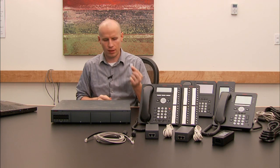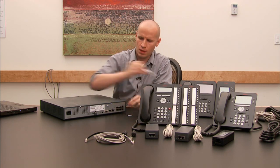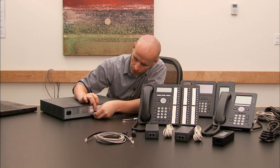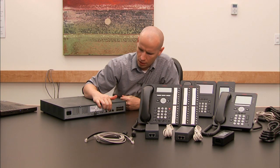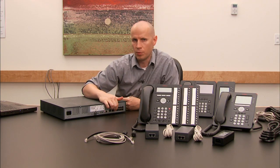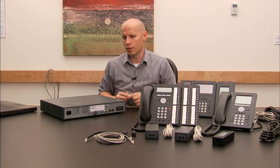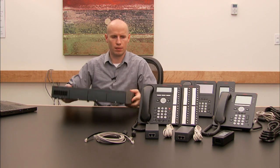The SD card goes in the back of the unit. If we turn it around, we have two slots: a system slot and an optional slot. This is going to need to go in the system slot, so we'll loosen up the retaining screw and slide it in. While we're looking at the back of the control unit, we have a few ethernet ports and also a reset port. This reset port is useful if you ever corrupt your configuration — we can always use this button to reset the unit back to default and start over.